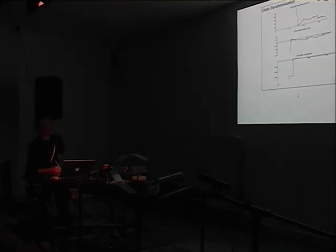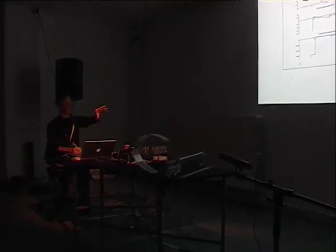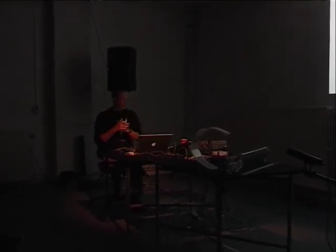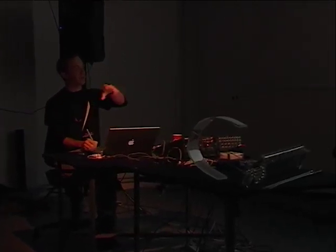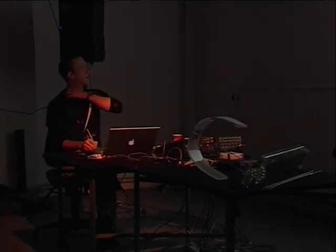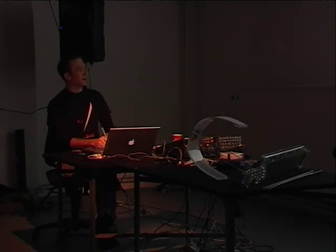So basically, there's a clock running on the microcontroller, and you can use this clock synchronization algorithm to set up a synchronized time domain between your host computer and the microcontroller. And then you can schedule events to occur at specific moments in the future on the microcontroller, as well as reconstruct the correct time order of things on the computer.